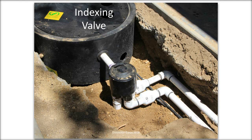Typical PSI for the Dayton is probably about 40 PSI, but there are thousands of pumps out there, and you can get higher PSI, higher head pumps. House water pressure is typically 60 or 80 PSI, just so that gives you a sense of it. These aren't quite as strong as the water pressure from a garden hose, but they're pretty close.